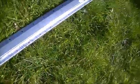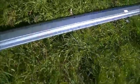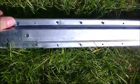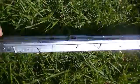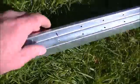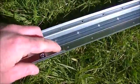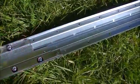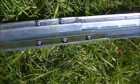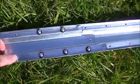In this case, this is the back rail for the base rail. It's 401.2 here that we're looking at on the left, and then it's 401.14 on my right. Now it tells you to overlap these pieces by 230 mil. So the way I've measured it is from the most pronounced point on the front edge here to the most pronounced point on the front edge on here, which is basically the frontmost points of each of those panels. You screw them up from underneath. I've only got 5 screws in there at the moment. It's capable of taking 6 screws altogether.